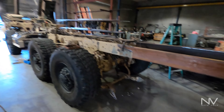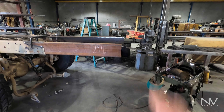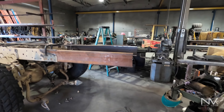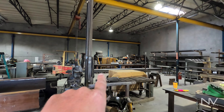You can see the rest of the suspension stuff we're going to hook up. The reason we're extending the frame this far is: number one, so I can put a 20-foot box on; and number two, so I can still tow, and I'm going to have a hydraulic lift back here for the spare tire and motorcycles. That's the main reason for stretching the frame out that far — that way you can mount all that stuff to the frame, not to the subframe, because the subframe is going to articulate on top of that.